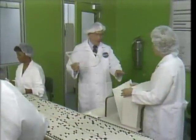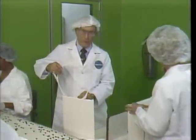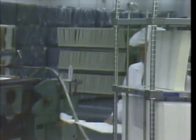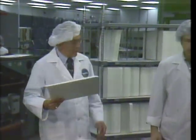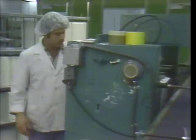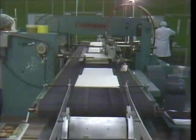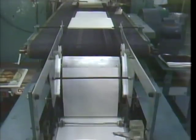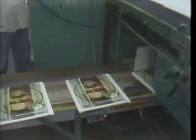Now, the spine is what interacts with the disc player's load and unload mechanism. It stays with the disc inside the player. Well, our caddy now needs a label. It's automatically fed onto this machine and aligned by electronic eyes directly over a pre-glued label. From there, it's dropped through a special wrapping mechanism that folds and bonds the label to the caddy. Our caddy, complete with its new label, is now ready for a disc,